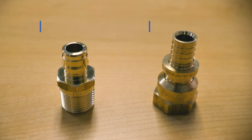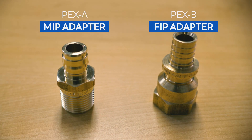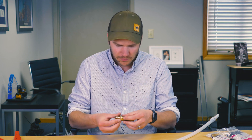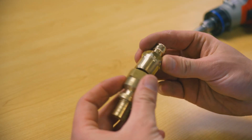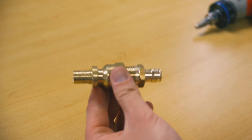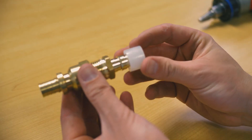Lastly, there is a threaded joint way to go from PEX B to PEX A or PEX A to PEX B. This is what the engineer or manufacturer may recommend if you're a contractor that needs a certified joint. You can see I have a MIP adapter — PEX A to MIP — and then a PEX B to FIP adapter, which makes a threaded joint.